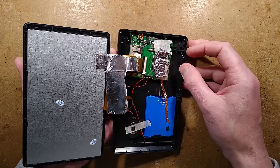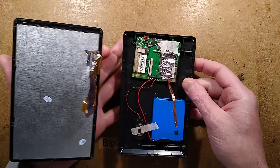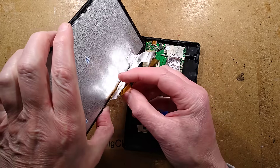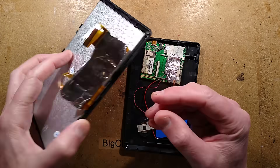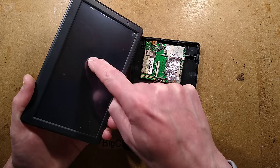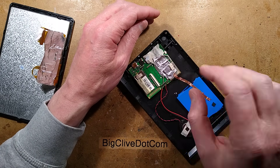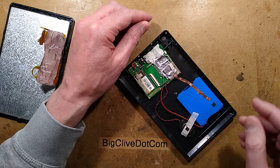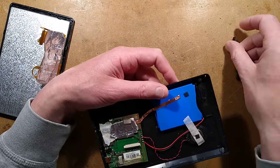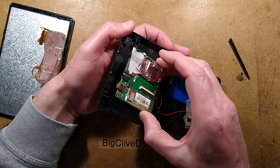Let's detach the keyboard. The keyboard, incidentally, is a resistive touchscreen. That means it's only got a little four-wire ribbon on it, because it basically measures the resistance from here to here and there to there where you press. I like resistive keypads — you can't gently swipe them, they're not very sensitive, they're very much a single point, but they can use a stylus. There is indeed a stylus. I like them because they're precise — I have problems with my big hands, particularly when the skin's hard when I'm doing real work.